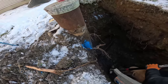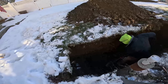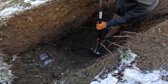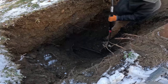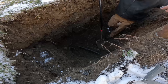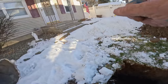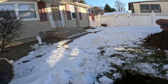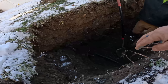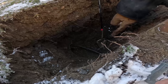Good habit to just paint your utilities so you can see them from the cab. I always put a mark where I'm going to be. There's our line exposed. Looks like an inch and a half inside diameter — hopefully we'll be able to cut it here and feed that new CTS pipe into that one to use it as the conduit. This is a crawl space so we can't get in there, and then the plumber can hook everything up inside the house where it comes up through. Worst case, cut, barb it, and go from that pipe to our CTS three-quarter.